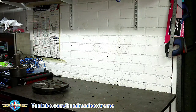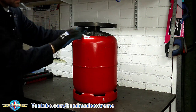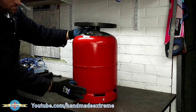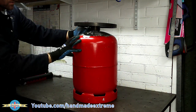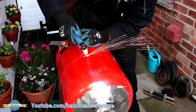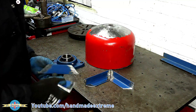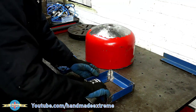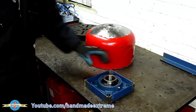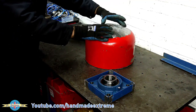Now I need something to put all of this inside and I've got this old tank which I think will work really nicely. The faceplate will sit on the top — it's got a nice curved top with plenty of room to get your fingers underneath to put nuts and bolts in the faceplate. I don't need all of that tank so I'm going to cut it off and just use the top bit. I'm using the plasma cutter to cut the top of the tank off — the tank's been purged and is safe to cut. To mount the bearing in the top I'm going to make a little box out of some bits of angle iron, and the bearing will sit in the box. We're going to cut the top out and sink the box into it so that it's all nice and flush.